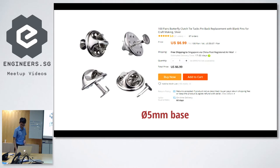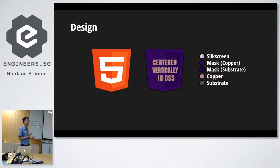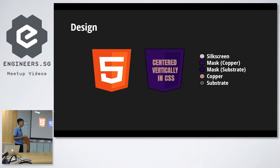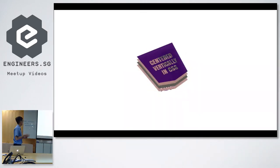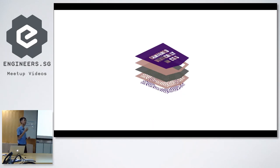So let's go on to the design. Like I said, you have a bit of a constraint because you have about 5-ish colors. The top layer is a silkscreen — usually white, sometimes black. And then the solder mask — your board house decides this; my board house usually uses purple, you can't change it. Usually you know it as green, like green circuit boards, but nowadays you have a lot of colors to choose from. You have your copper layer, which is usually plated with either tin or gold. And lastly you have the substrate, which is the fiberglass part in the middle that holds the whole thing together. So with this in mind and these color constraints, I thought I'd make something very similar to a popular HTML5 wordmark. The center design is what I came up with — this is the final design, and it's a composition of a few layers.